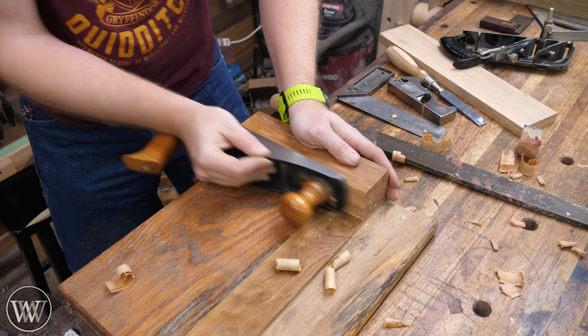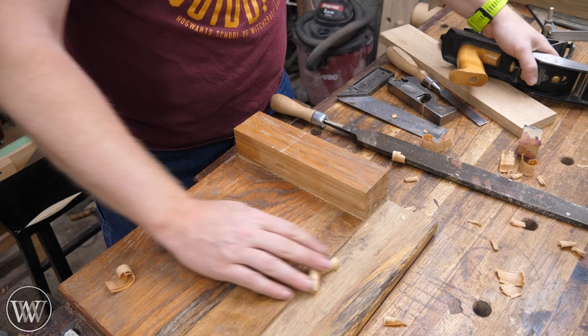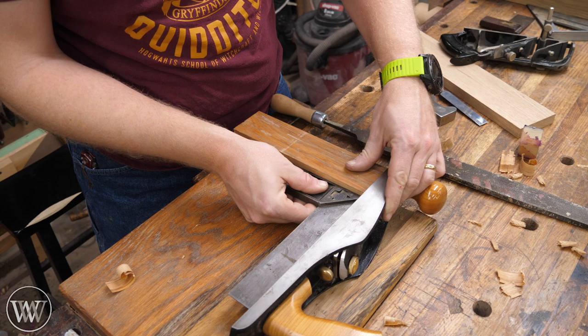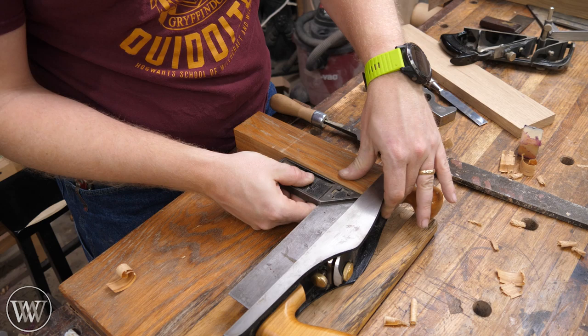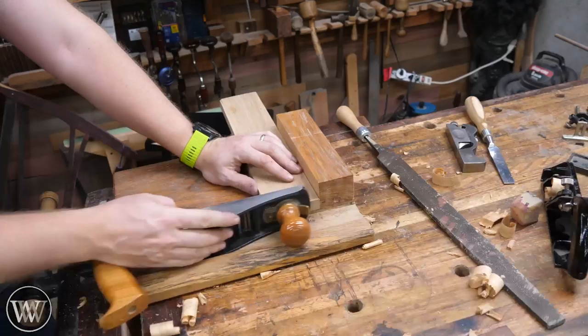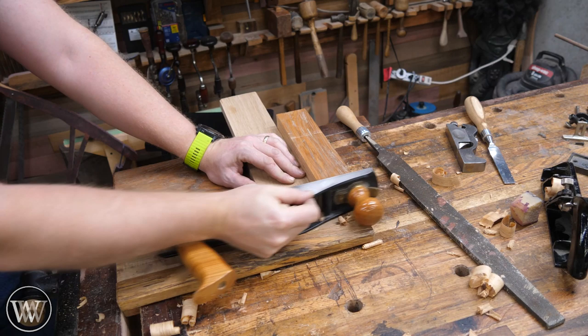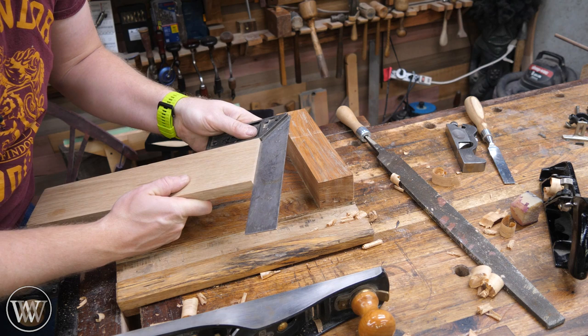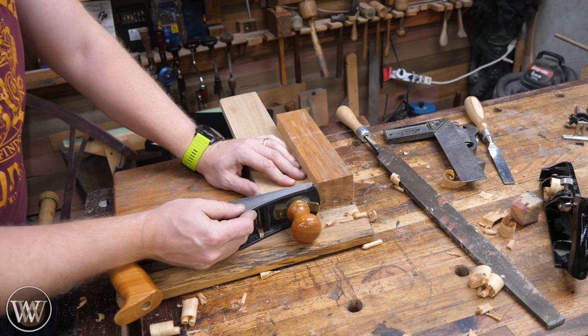So now we've taken off several shavings and smoothed this down. We can put our plane back in here and check for square again. Right there, I've got to take off like one or two more shavings and we should be pretty good. So I'm going to do one shaving here, back up a little bit farther, one shaving here. Test it again. And that's what I'm looking for — absolutely, perfectly square. So then after a few quick shavings, we can bring it back and test it out and see just how square our board is. And that is dead-on perfect. Now I don't have to think about it — I can just bring the plane in here, square it up, and I know that when I take a shaving all the way across, it's going to be dead-on square every time.